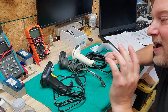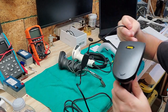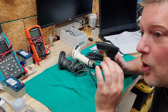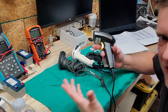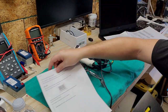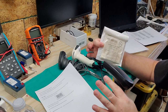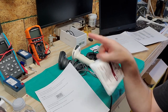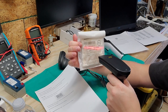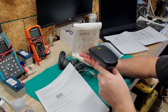Let's start at the absolute basics. I have my laptop here just as a power source to demonstrate. This one is a traditional one-dimensional barcode scanner. A one-dimensional barcode is just a regular barcode. This is called a laser scanner because it takes a laser with a little mirror that vibrates at an extremely high frequency, producing a fine line. The key is the barcode has to be horizontal to the beam, or it will not read.